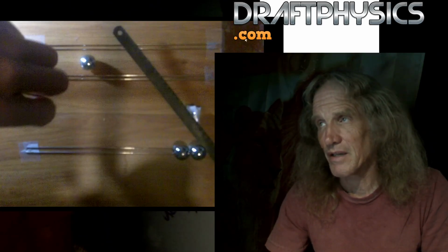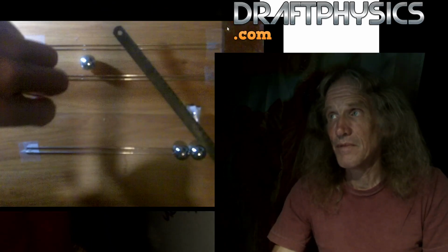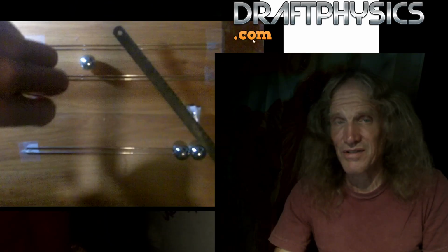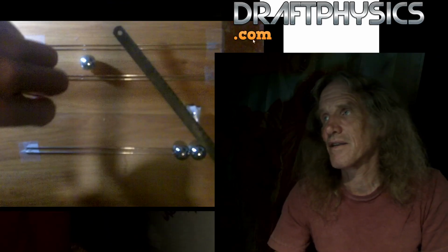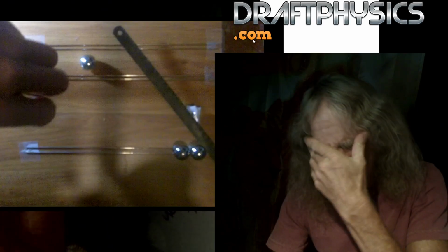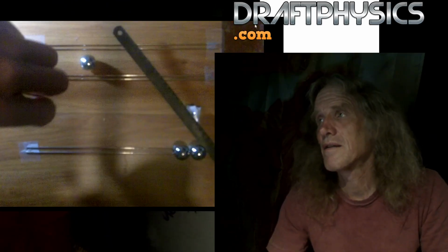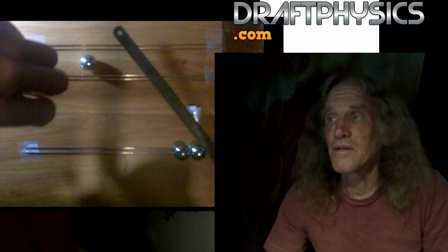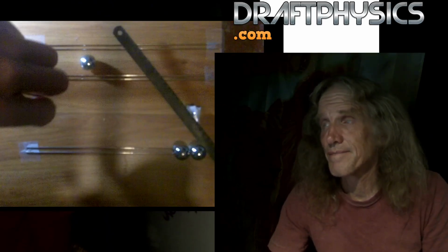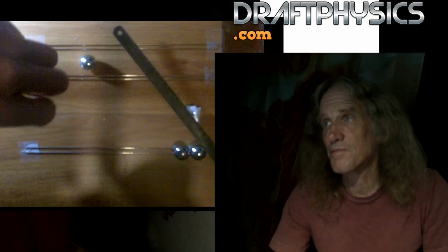Like I said, this rail thing is sort of imperfect, because that's another part where it doesn't hit the same surface. It sort of goes against the surface and then slides across the surface, and that's not ideal either, as you're technically not putting the energy in the right direction. So it'd be better if it was a perpendicular contact. So that's something else to consider as a problem, and certainly there'll be friction on that edge, so that's another problem. So lots of problems to work out yet.